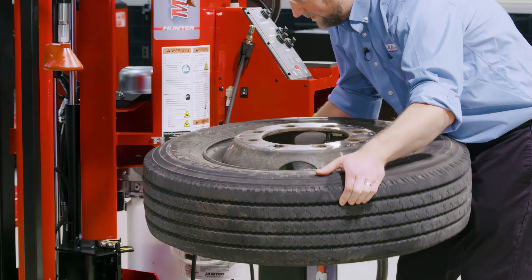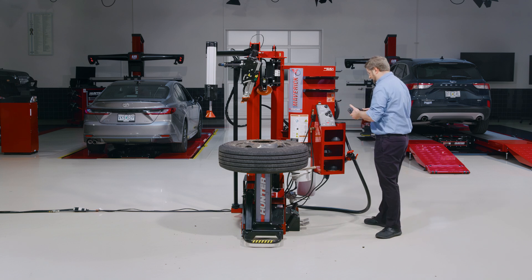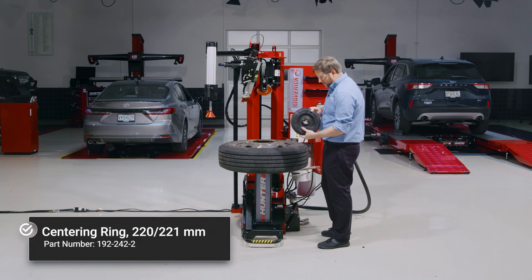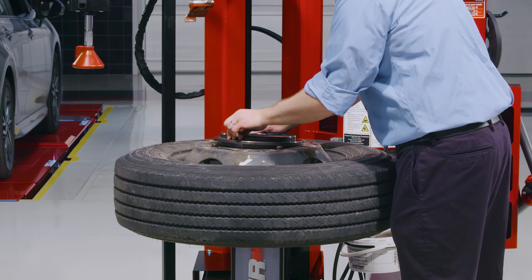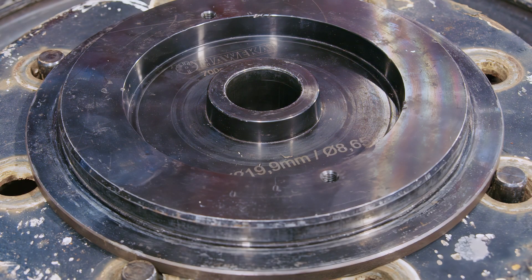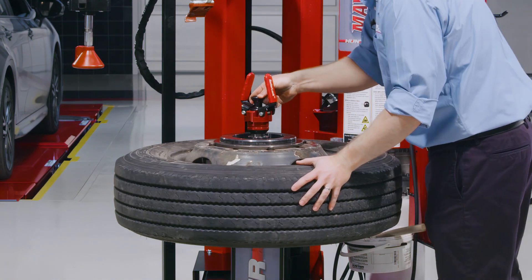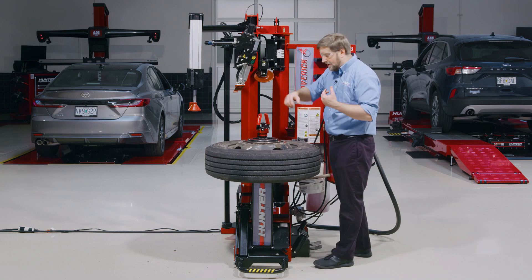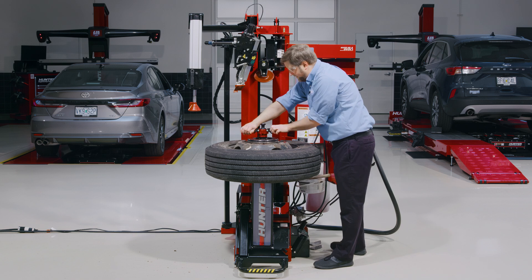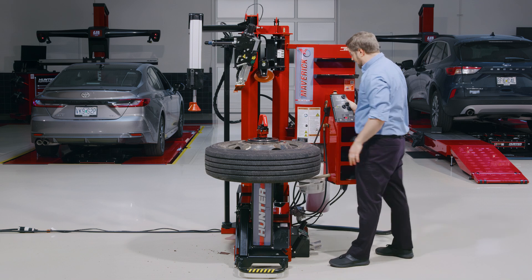It takes a little wiggling to do when everything is rusty. Now at the top I'm going to use another flange plate piece — this is the 865 and 869 balancing adapter. I'm going to put that down on top; that's going to serve as my top clamping plate. Go ahead and run my clamp shaft through. I'll typically run clockwise just a little bit until I feel my traction pin grab. That's the direction it's going to be loaded, so I'll go ahead and cinch it down nice and tight once that traction pin is in position against that flange plate. Give it a little extra torque there.